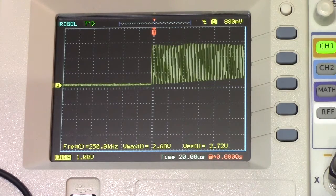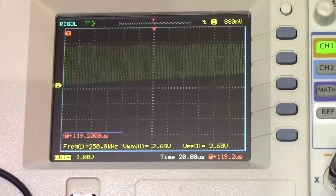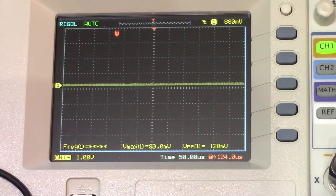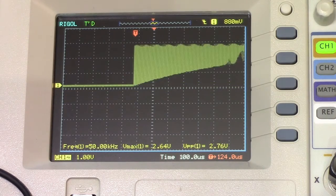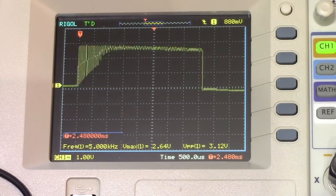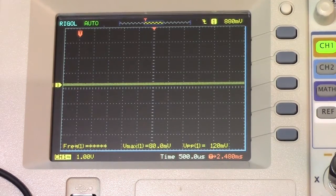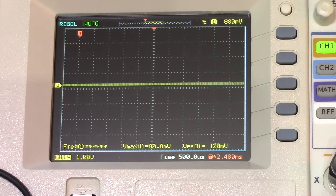That's not looking too good. That looks like it might be trying to rise, but it's obviously not making it. So I think this chip might be having some bit of an issue, because the good ones kind of flicker a bit and then go up. That's just a very big difference. Yeah, I think I'll just try and disconnect the source button and make it so we can only switch sources from the remote. Because it doesn't seem right that one button would be different from the others, and that it coincidentally would be the button that doesn't work properly.